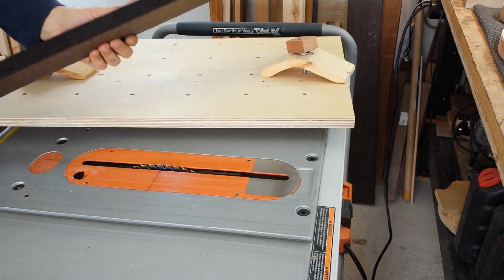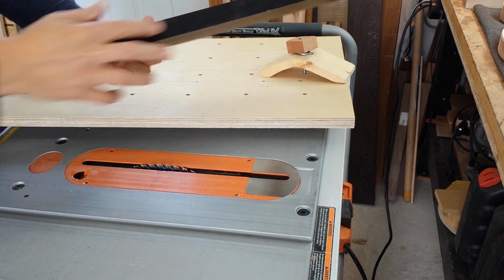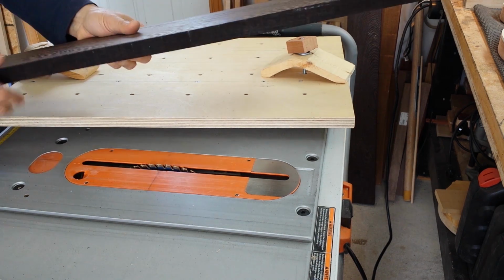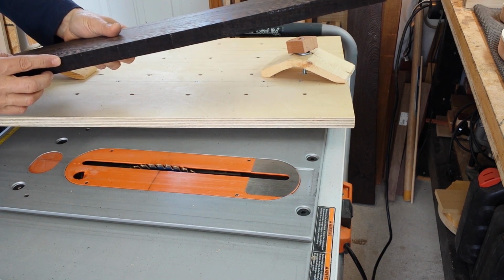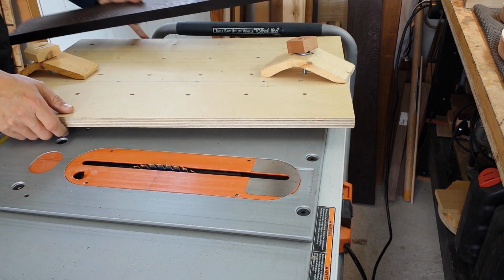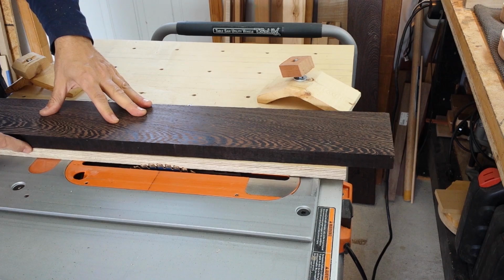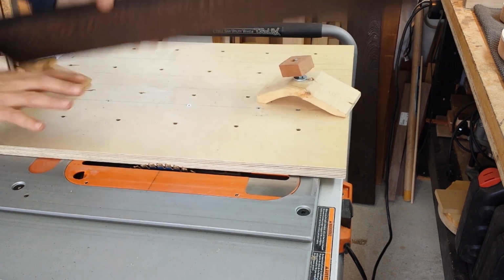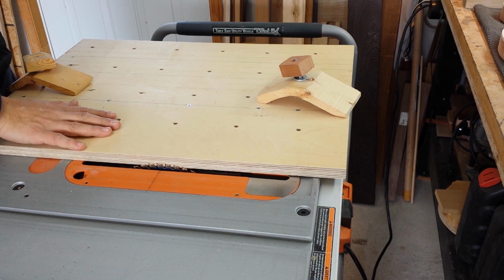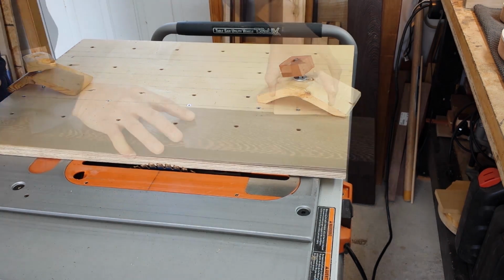Now, another issue I noticed with this board is that both faces are not flat. And when I run this on the fence of the table saw, I need a flat surface. So I'm going to use this jig to run it in the table saw to get a clean edge. I have a full video on this jig, and I'll put the link to that video in the description of this video.